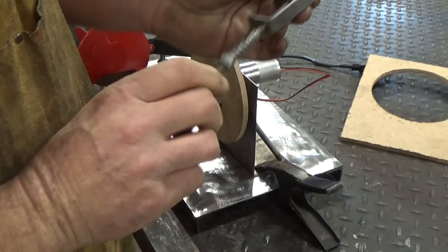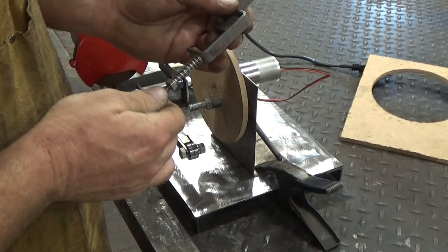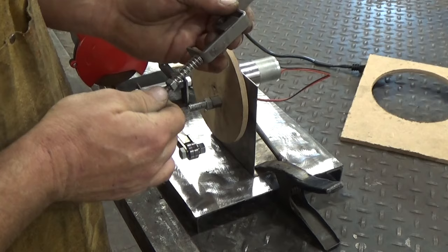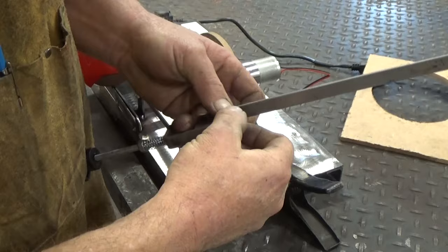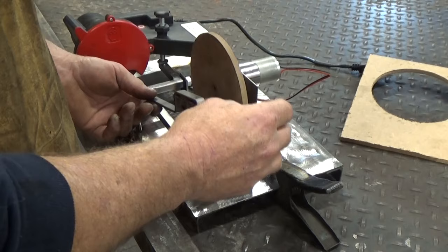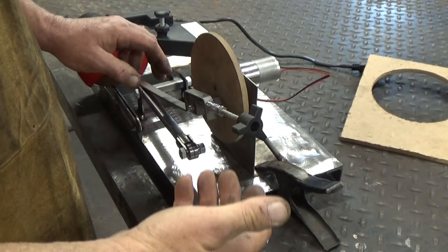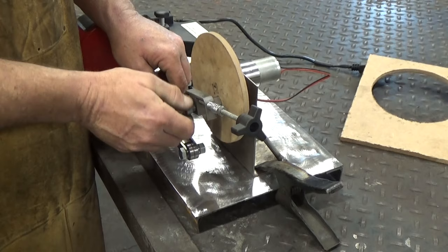This is my quarter-inch all-thread. These little nuts are just red Loctited on. There's also a spring. When you put this together and tighten it, it creates tension on the rod so it won't come loose — it'll stay in whatever position we determine. I'm going to move it to just about the halfway point, push it through, put a nut on it, and there you have it. Moving this way pushes the rod out; backing off pulls it back.